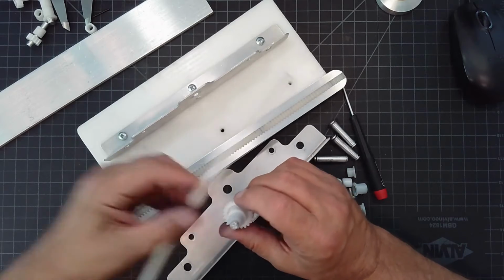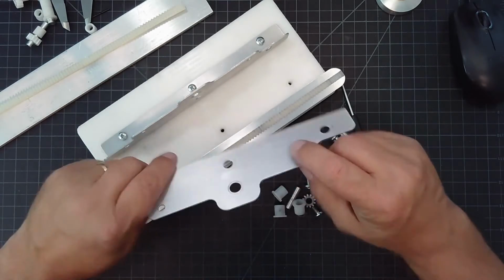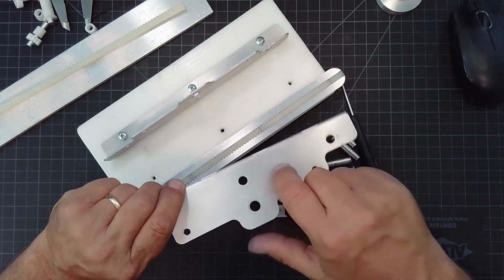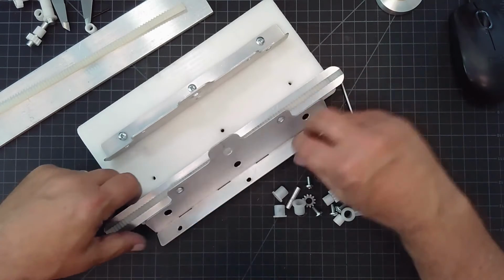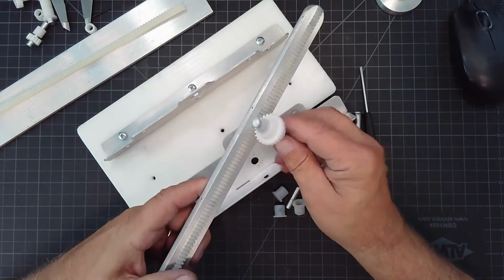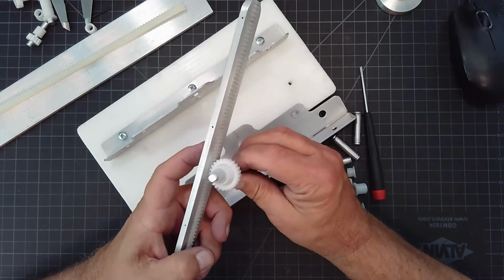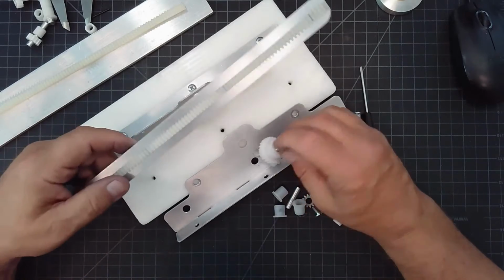And you'll maintain those distances by these side holes right here. This one's for the pinion gear, and this is where the slide assembly is going to sit. So by doing the calculations, you should be able to get that really nice and make it so that the relationship is loose enough that it'll move fluidly, but not so loose that if it sees any load it will end up binding.